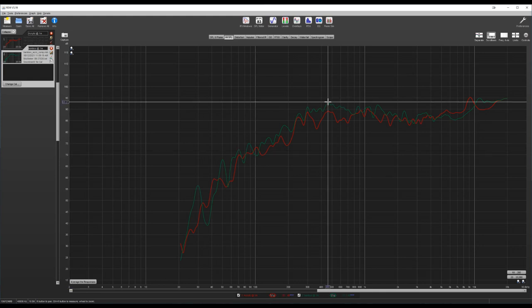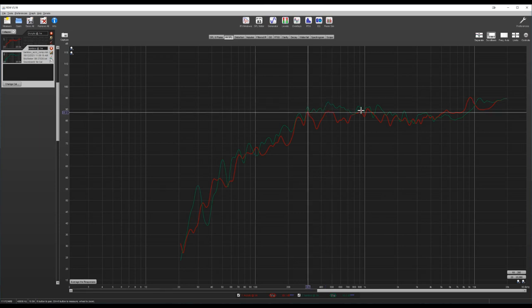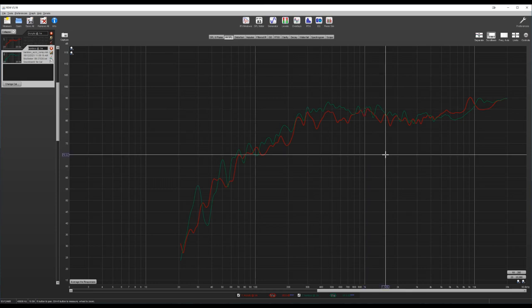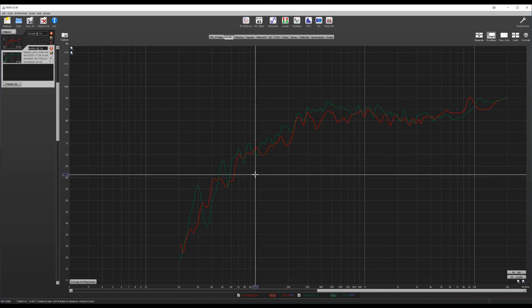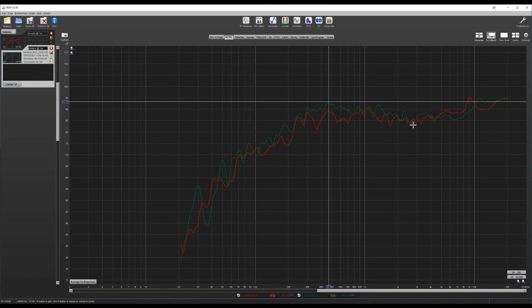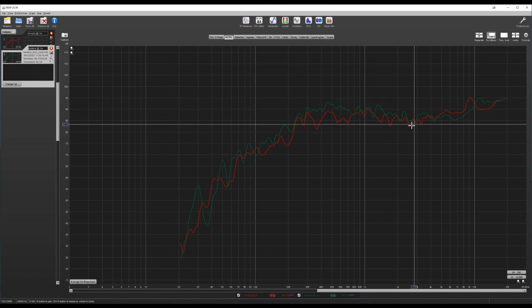Okay, so right off the bat, it looks like the bamboo has a slightly higher SPL overall. I'm not surprised by this, as I have always assumed that the rigid panel fitment would have an effect on SPL. Neither panel's doing much of anything below 100 Hz, and they both only really flatten out from above about 250. After that, they're both pretty flat, remaining within 10 decibels right through to the mids and into the high frequencies. As I detected in the music earlier, the red acrylic does overtake the bamboo in the high end.